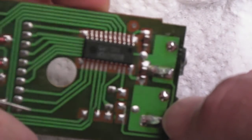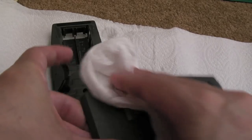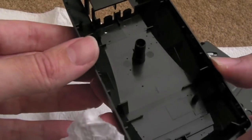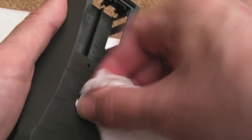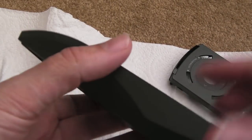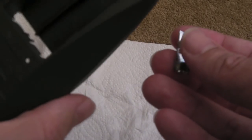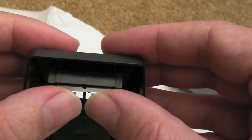Whilst we're here, I've reflowed the connections on the other sides as well. We'll just get a cotton bud with some IPA and brush that down. I'm just drying off the pieces here after they've been washed. I'll show you how to test an IR diode in a minute. Just try and knock out any bits of moisture from underneath — you can see just a few bits there. If we leave this for a period of time it'll dry on its own, but I'm keen to get it back together. Get some tissue down there just to get the moisture out. You can see it's looking a lot cleaner. We can get the battery contacts back into that piece now — I've cleaned those up with the fiberglass pen. Lovely and shiny, no corrosion on there.